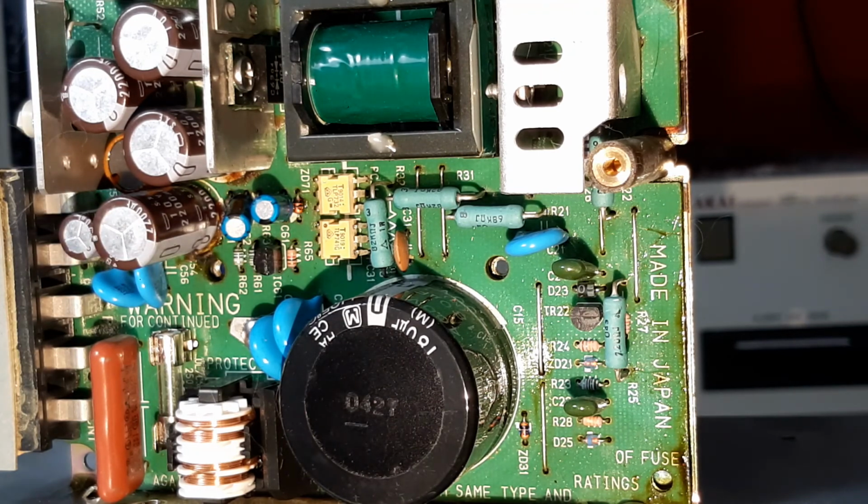So what I'm going to be advising is that if you are competent and it isn't a very hard job, you record your values of the caps and check your fuse. You might not even have to remove caps. I've seen leaky units still run. It's ideal to be changing them, so if you do see any leakage, just change them out.